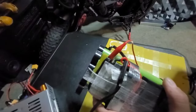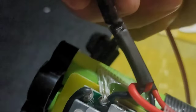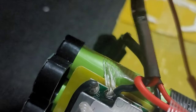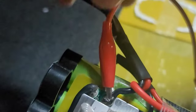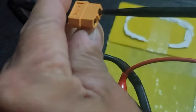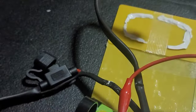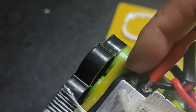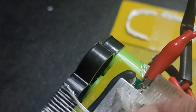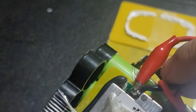What we're going to do is look for where the grounds are connected on the BMS. If you notice there's another ground wire right there — and that's actually the ground wire to the connector. We're going to put our alligator clip right there, and I'm pretty sure when we test it we're not going to be getting anything — which we're not. So that means we have a bad BMS. The ground is good right there, but somewhere on this circuit board there's an opening that's not making connection to where the ground is on this connector.